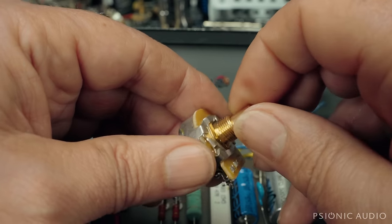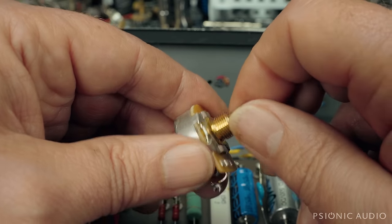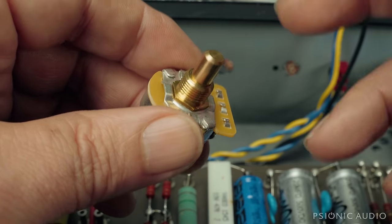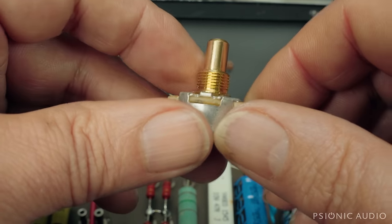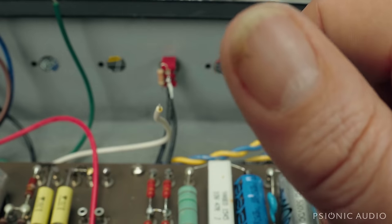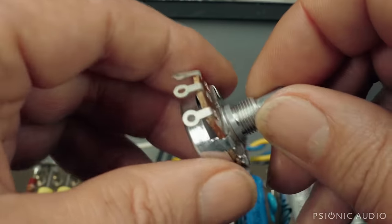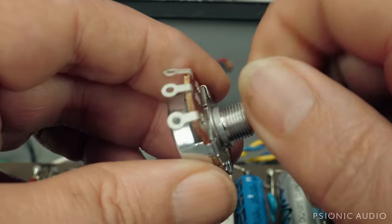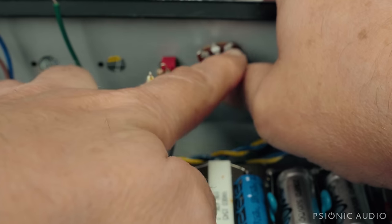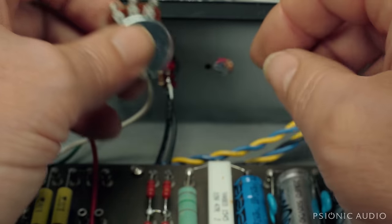These low torque pots aren't really needed in a guitar amp, and they don't come in 1MB reliably — they're hard to get in 1MB. And the other issue is that these brass ones don't come in all the values and tapers necessary for all amps. So it's fine to use one if it works, but it's not a great choice. The alpha 24mm will do very, very well, and I've had very few failures with them. At about a buck fifty each, if you get a bad one you just change it out. It's very nice to be able to do that when it's mounted to the chassis and it's hardwired — no big deal to change that out versus a little PCB-mounted pot.